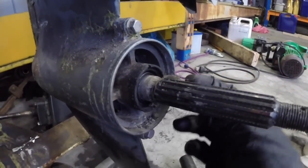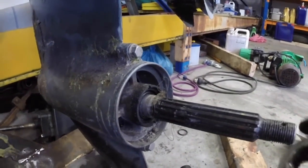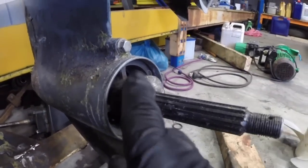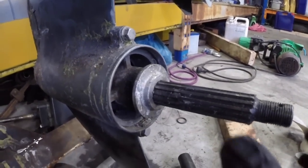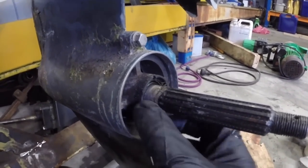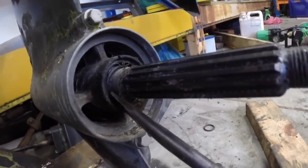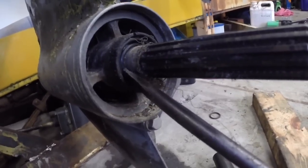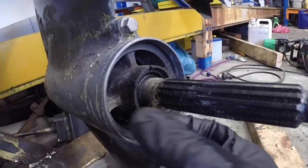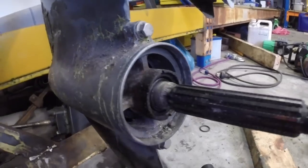Now is a great time to have a look for fishing line on your gearbox. If the thrust washer stayed on the gearbox and you took the prop off, make sure you slide it off because fishing line will get behind that washer. And in behind here are the oil seals that stop salt water getting into your gearbox and the oil getting out. This fishing line will cut those seals and damage them. So make sure you pull any fishing line off from the prop shaft as well.